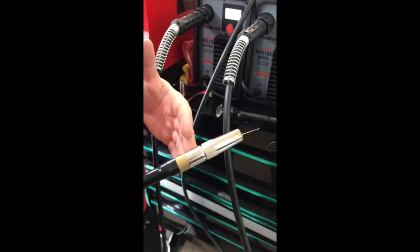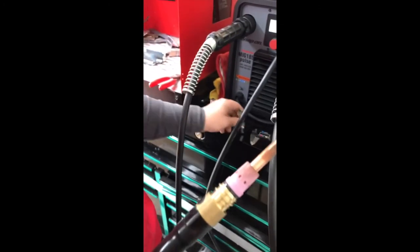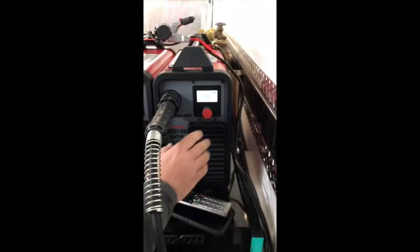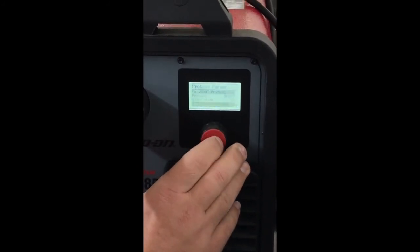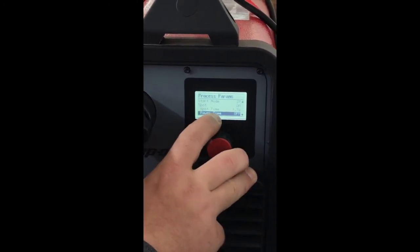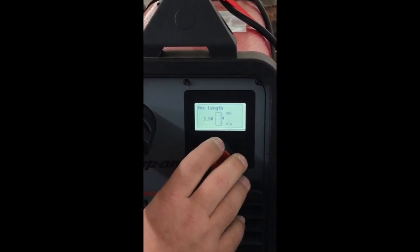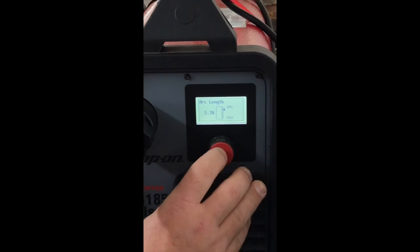To switch the machine from a regular steel weld to a spot weld, all you're going to do is unscrew this nozzle — don't lose the porcelain. Then your spot weld nozzle has a little collar, so put the collar on and slide the spot weld nozzle tip on. On the machine, press and hold for two seconds to bring up the menu, scroll down to spot, tap it, change spot to on, and tap it again. I set my spot weld time to 1.7 seconds, then press and hold for two seconds to go back to the main screen. To get that weld flat, tap and turn my arc length all the way up — on mine it's 5.7, but yours might vary — then tap, and you're ready to go.